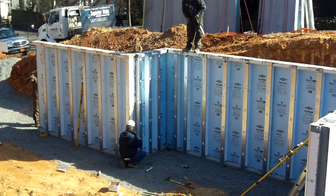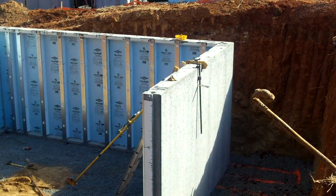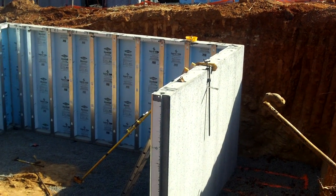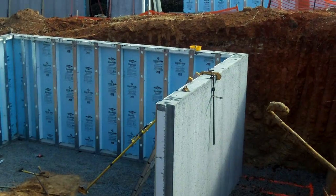What was nice is we had these foundation walls made off-site. As you can see, we have a layer of concrete on the outside. On the inside is an insulated form and it also has the studs and conduit in there so we can run the mechanicals through pretty easily.